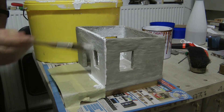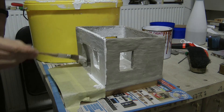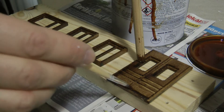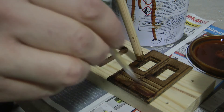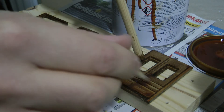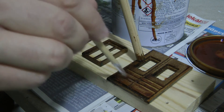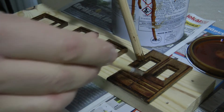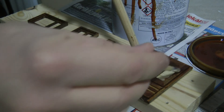Once fully dried, I applied two layers of white exterior paint — the same paint used around the house, nothing special, simple off-the-shelf home improvement store exterior paint. I also painted the inside. In the meantime I started milling the doors and windows, all different sizes, measuring each opening and milling them out. I used three layers of wood stain and sprayed matte varnish at the end. I had some leftover plexiglass for the glass panels, glued on with simple wood glue. The windows and door sit inside the opening, and I fixed them with construction adhesive which also sealed the gaps between the windows and the concrete structure.